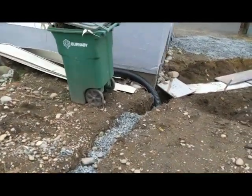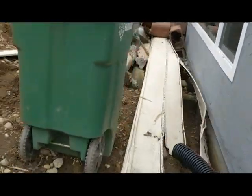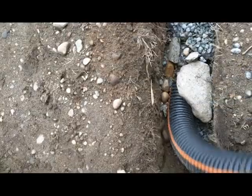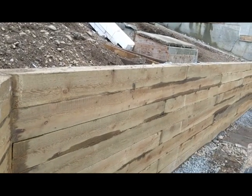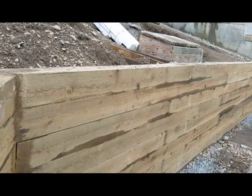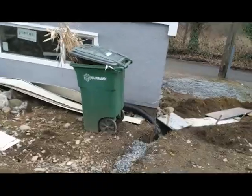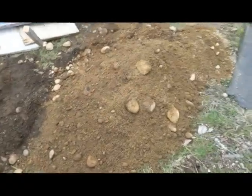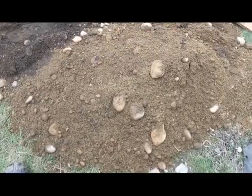Pretty much how it goes — the big pipe, I'll show you here in the sand. You guys can see gravel underneath and gravel on top. To tell you the truth, probably no water is gonna run inside this drain pipe behind the wall, but just in case we have it there and have it connected. This place is on a slope, and it's very much sand and rock in here — just to show you guys, this is the type of what we have underneath. It's just rock and sand, and very well drained soil.